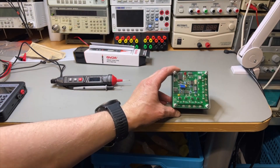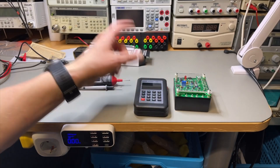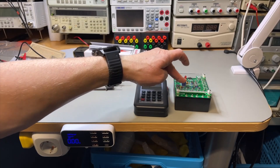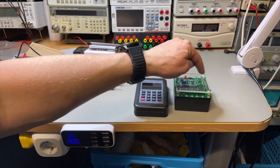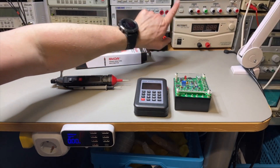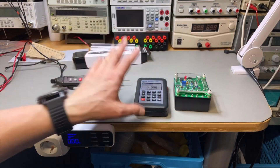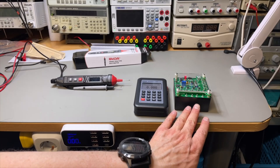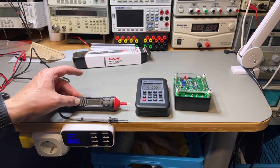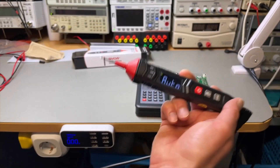I have my DMM checklist out and my reference meter, the LBO2A. This reference unit provides a fixed 5V DC, 5V AC, and has 1% tolerance capacitors and resistors we can test with. For a six-and-a-half digit meter I'd want a half-hour warm-up, but with 6000 counts this will be fine. Switching it on — it's in auto mode.